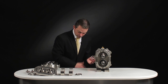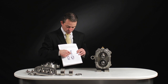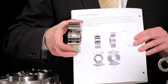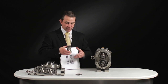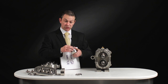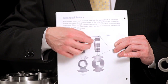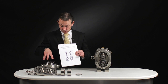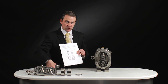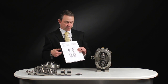The conventional rotor shape is like a cantilever, supported on a single hub, whereas our rotor is supported symmetrically in the centre. As pressure acts against the conventional rotor it acts radially and distorts it more, causing the hubs to move outwards and potentially contact the rotor case. For every revolution under pressure you could get contact between the rotor and the rotor case, which reduces efficiency and puts particles in the product.